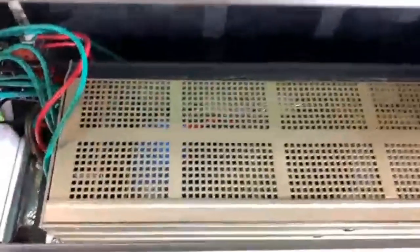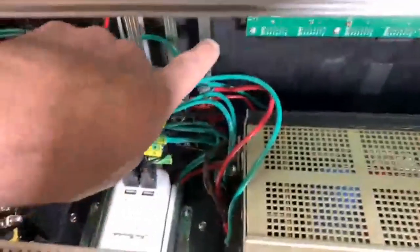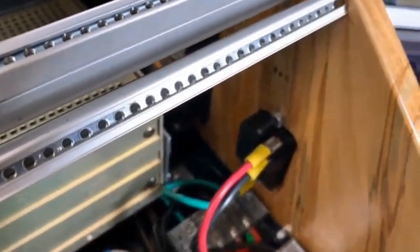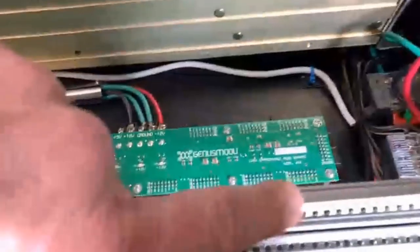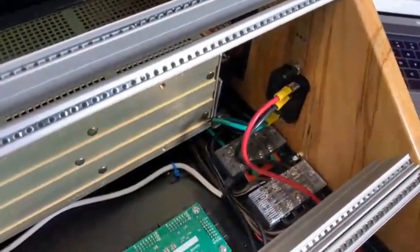And that's so you can do funny things like I have this supply wired in backwards, where its +12 is actually going to my ground bus, because I want to use what's 0 on this to feed the -12 bus in this system. So I had to have isolation between the input and output on it. But at the end of the day, you really want to tie the ground for your DC power to the ground for your AC connection. One, it's safer in case something shorts out. But two, that will lower the noise in your system. And even this system in its original configuration had a little bit of noise in it, but as soon as I ran a ground strap from these rails to the mounting rails for my mixer, the noise level went down.